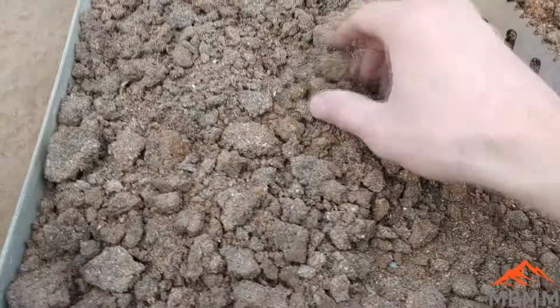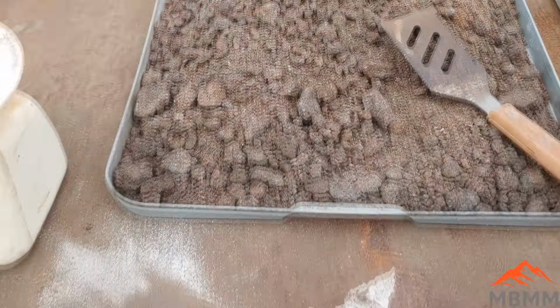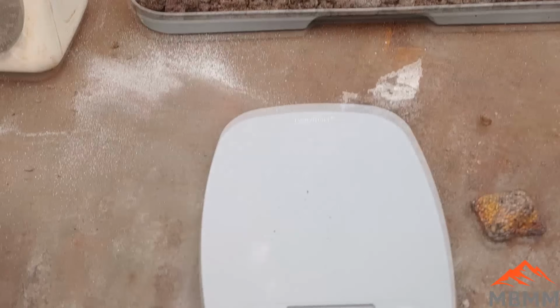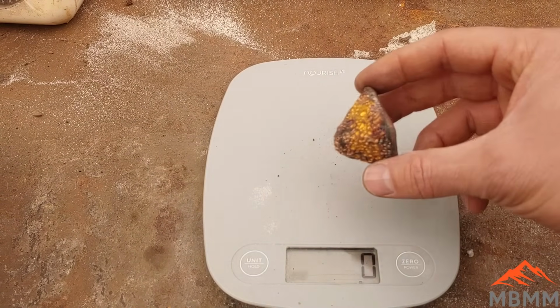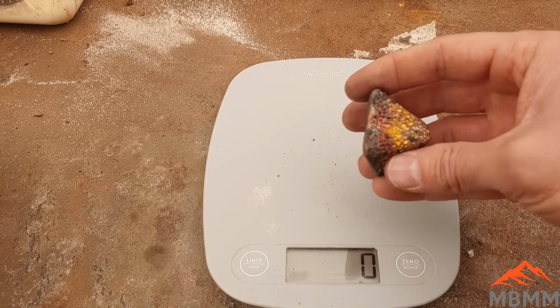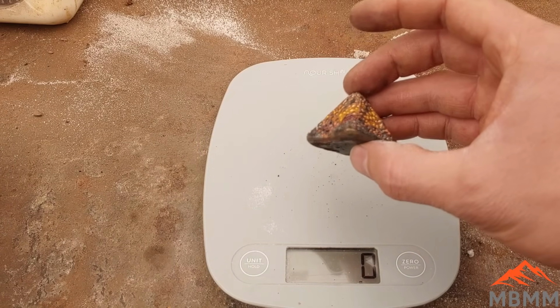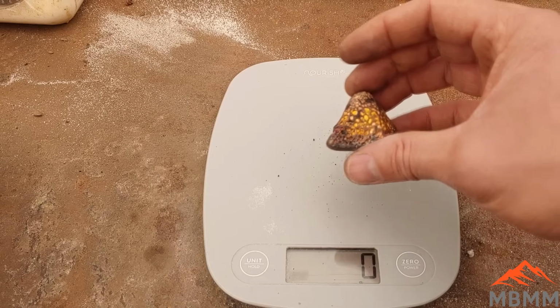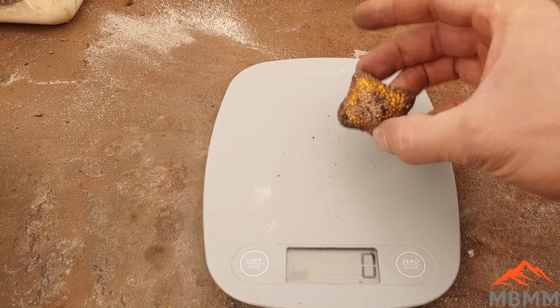And you can see this stuff is rusted and oxidized. So when you put in 200 grams, probably a lot of the oxides went into the slag. And then we probably removed some of the other base metals with the iron and the sulfur. But there you go. So now, hopefully, we've got mostly copper in here, precious metals, and a little bit of other base metals that we didn't get sulfidized, I guess. And so we can take this now, pour it into anodes, and electrorefine the copper away, get the copper as a saleable product. And then in the slimes or the sludge, we can get the precious metals and some of the other base metals and refine those out, and we will be able to 100% process our PCB metals.